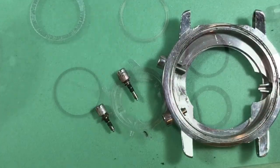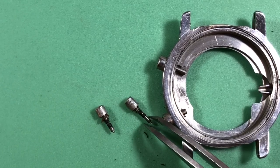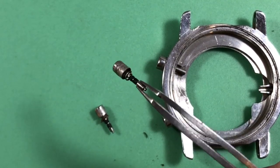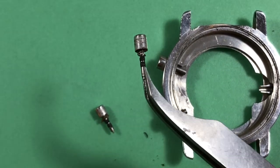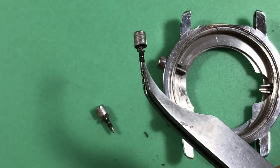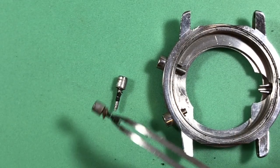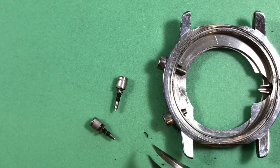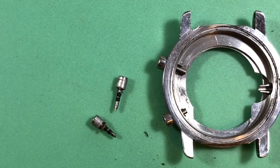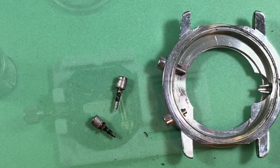Okay, so let me get on. Yep, there they are, out. They are in fact the 2-seal variant. You can see them, they're stacked up. The earlier ones only had one, and that proved to be insufficient for long-term use. You can see those there. There's the spring and those original gaskets and some grot. So I'm going to hand clean all of this stuff, and then it's going to go through the ultrasonic, and we'll get it nice and shiny.